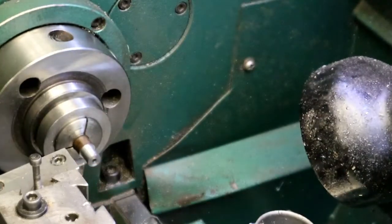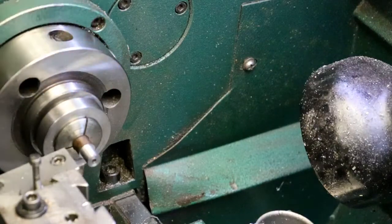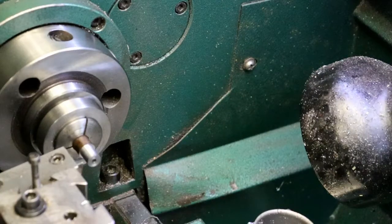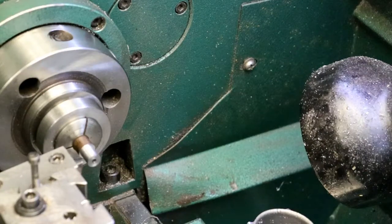I don't know, boy, I'll have to really be careful with that tool. I'll have to sharpen it and wind pretty slow. Otherwise, it's just going to flex away, unless I get a grind up one. And we'll try this first. So we'll go 80 thou, 50, and the 80. That's the land on one side. And we got to go in 100 thou from when we touch.